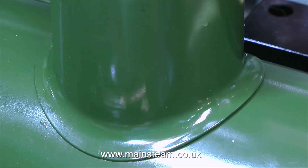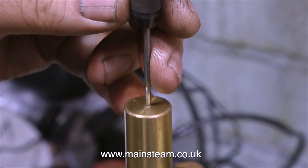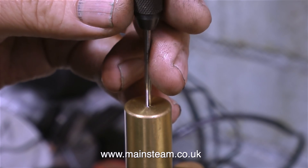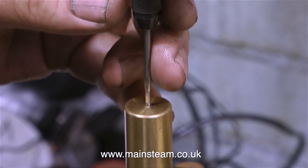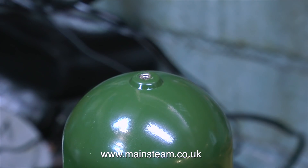Now the outer dome is a real problem — it leans a little bit, so I'm going to have to fix this. The first thing I did was re-thread the hole in the top of the dome. This hole doesn't go all the way through into the water space; it's just a blind hole, so I've been very careful not to snap the tap off. The original small bolt that held this dome in place was minute — about 10 BA, or a metric equivalent of about 1mm. Far too weak.